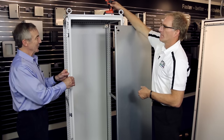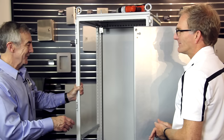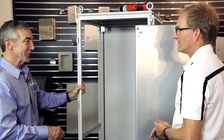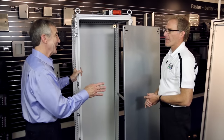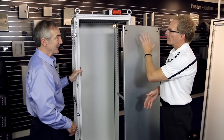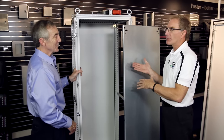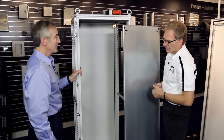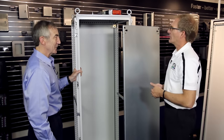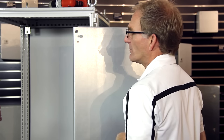If we were using a conventional panel in a welded cabinet, it'd be heavier and the panels would be thicker gauge steel. With a competitor's standard painted panel, there's a lot of prep work, and typically you'd have to lay the cabinet down and hoist the panel out with a crane — a lot of time and labor. We just simply slid ours out. The benefit here is what's called hot-dip galvanizing — many people call it zinc plated, but there's a difference. There's no prep; once you put a component on, it's instantly grounded. It gives better corrosion resistance and increased shielding effectiveness from the zinc coating.